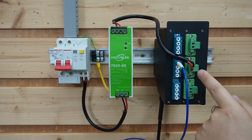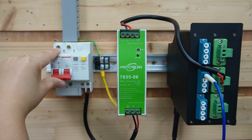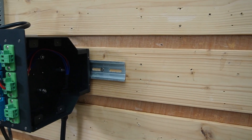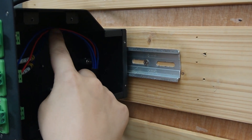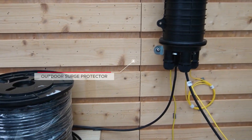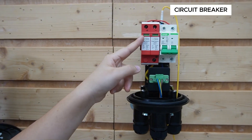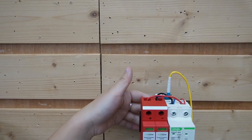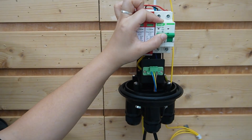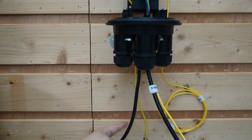Here is the fiber and here is the power conductor, connecting to our DC 48V power supply and to a breaker for safety. Now I'm going to turn it on. Inside our termination box we have the fiber and our power conductor, and we connect it directly to our outdoor surge protector. Inside we have a breaker and the surge protector itself. The fiber optic cable comes through at the back and connects into a fiber patch cord, and the power conductor connects through our breaker to the surge protector. If you're in a lightning-prone area, make sure you put a surge protector on both sides and follow the local grounding code — we already grounded.